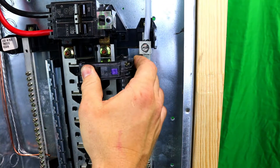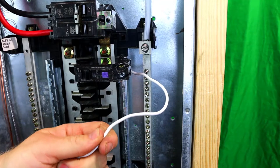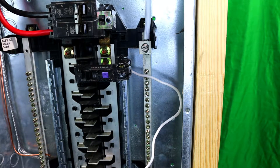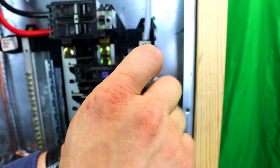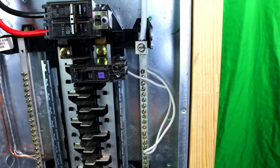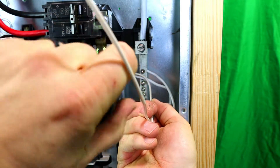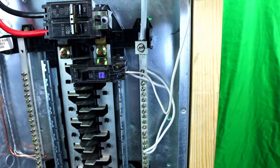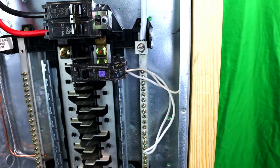The panel is completely off. I'm going to unroll the pigtail and leave it long for this video — you can dress yours up as best you can. We're going to put the neutral from the breaker pigtail into the neutral bar lug and tighten it down. Then we take the circuit neutral and put it into the breaker. I'm not going to dress these wires up because this panel has been used in many videos and I don't want to shorten the wires. If you're doing this for real, make your wires look neat. Same goes with the hot — we put it into the breaker.